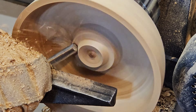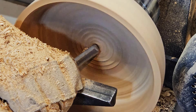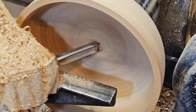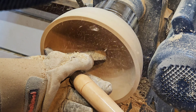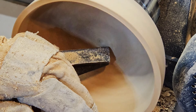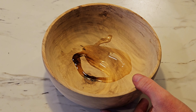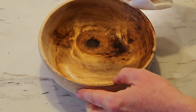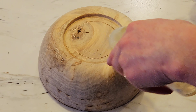Yeah, here you can see I'm just pushing like crazy. I did sharpen between the last cut and this cut, and you can see right away the shavings are much cleaner — it also doesn't feel like I'm trying to push a boulder uphill anymore. Right here you can see I'm just pointing my bevel into the cut; it works so good, it's so clean. To flatten the bottom I switched over to my one-inch scraper, and then to my round nose scraper for the sides. I've also found that if I tip that scraper on its side a bit I get a much cleaner cut.